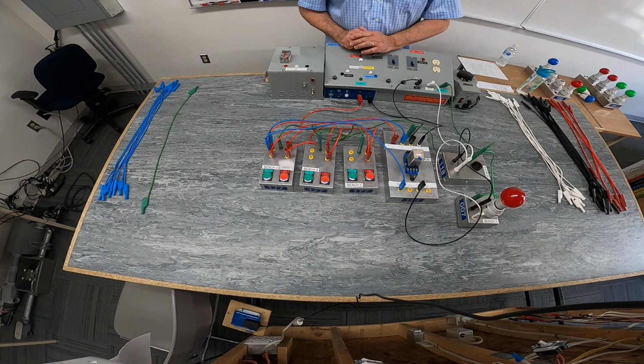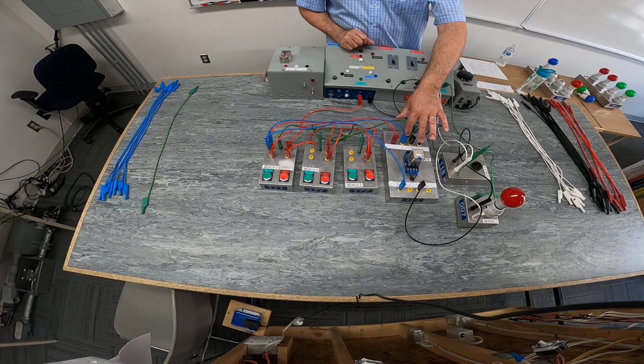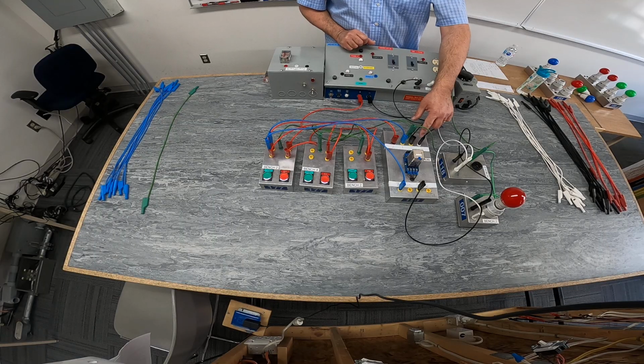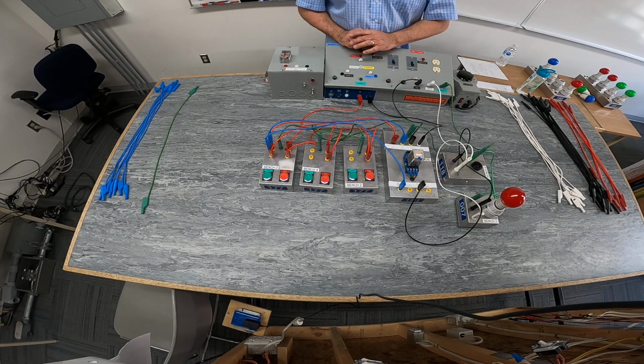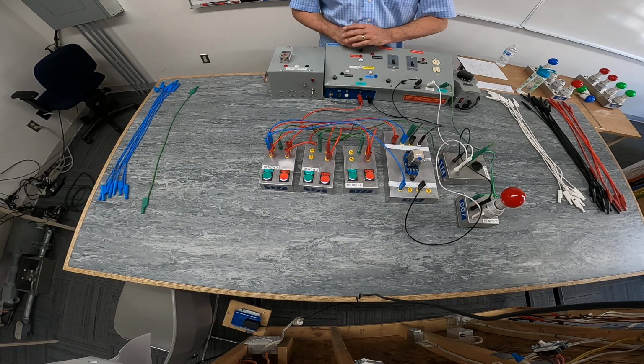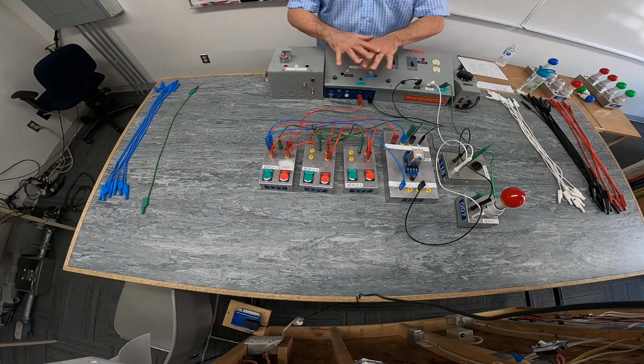In this case, for this relay here, our coil was connected between 2 and 7. We have two sets of armature, like I said. Common is number 1, between 1 and 3 is normally open, between 1 and 4 normally closed. The other armature, the common, was number 8, between 8 and 6 was normally open, 8 and 5 was normally closed.